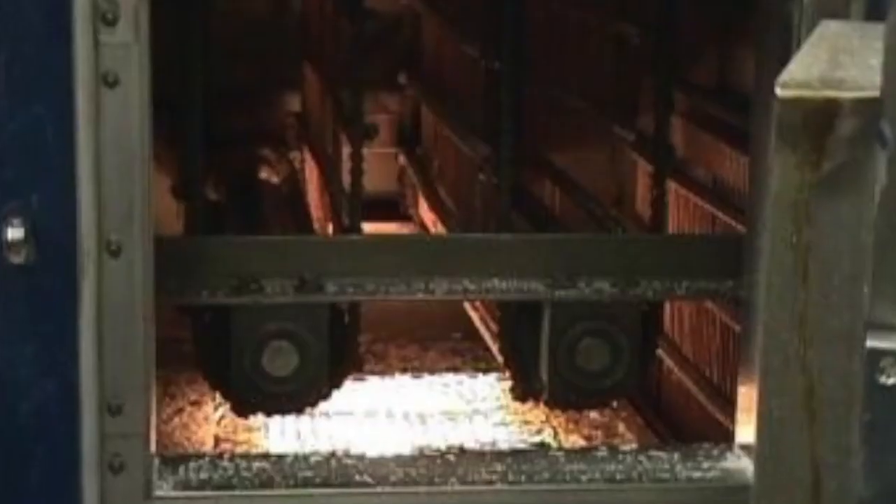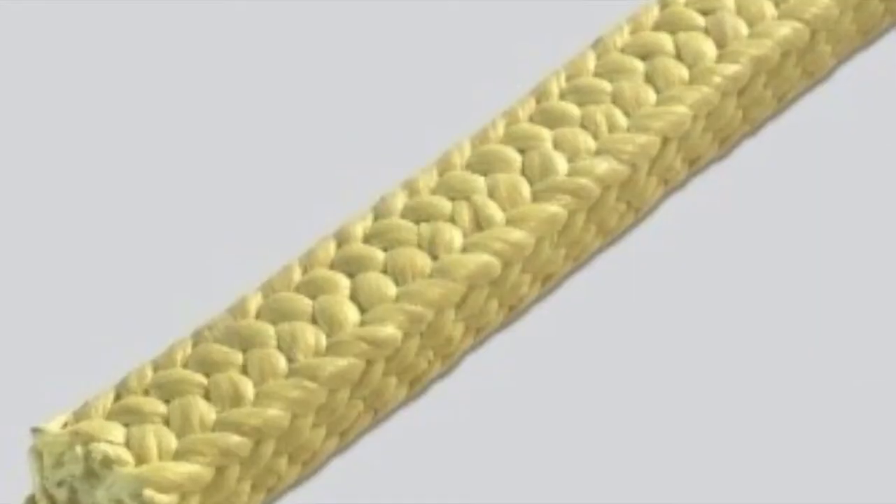Regarding the quality of the packing, some issues to consider are the purity of the materials and the density and gaps in between the strands of the braid. This is based on the braiding machine's weights and tensions of the fiber during manufacture.